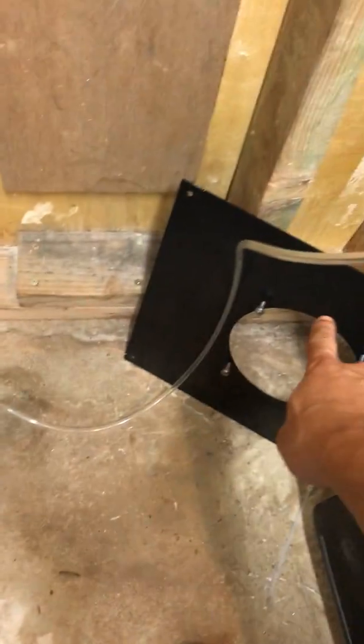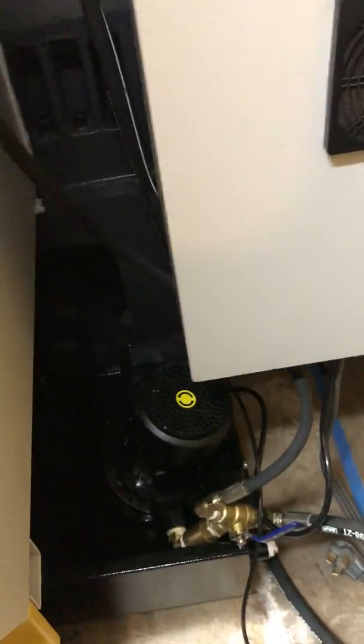It actually sits in there, but I took it out for now because my machine isn't on the level feet yet. I wonder if I can bring some out to show you. It's supposed to sit on these, but I got so excited when the riggers were installing this that I forgot to tell them to wait for me to put the feet under, so I've got to work something out. But there are threaded screws, these things, that go into the casting base. There's 4 of them, and they eventually sit on here.